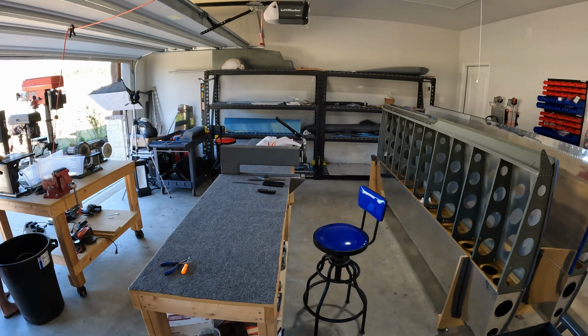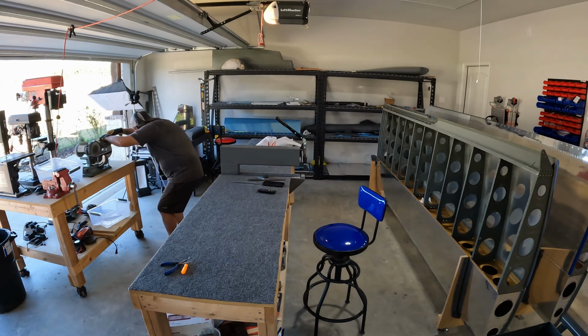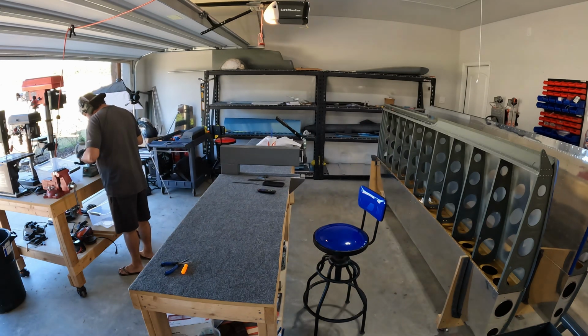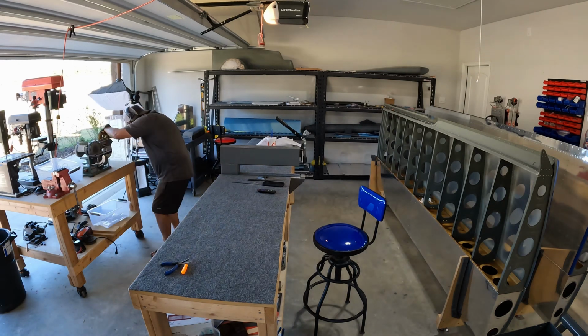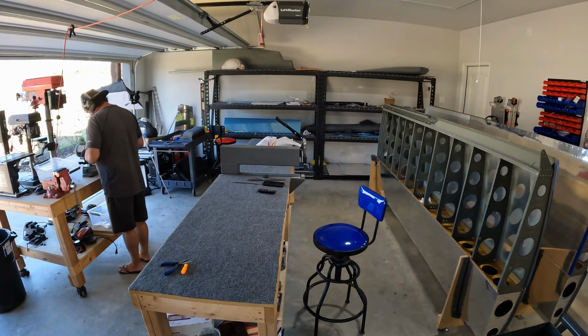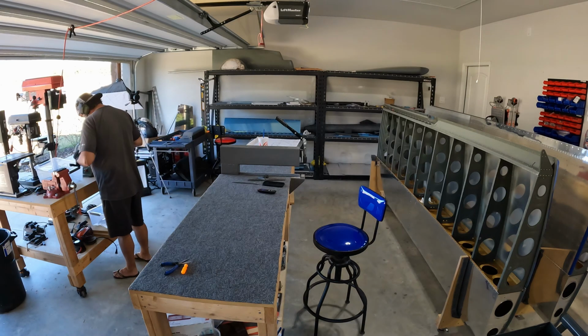So if you're at that stage and you are working with Pro Seal, yes, that is like prepping for surgery in terms of how clean you want that stuff to be. But for spraying some self-etching primer on these parts, scuff them, wipe them down with some acetone, get on with your life. It probably would have saved me an hour of what turned out to be 4.5 hours today to do these 32 skin stiffeners. And that's all the stiffeners for both ailerons. So that part is done.